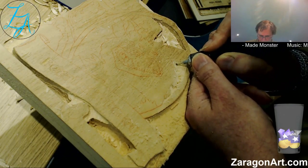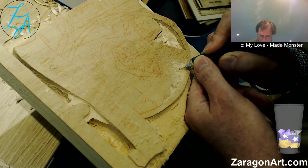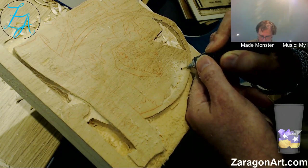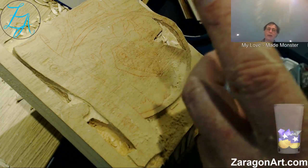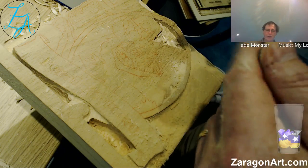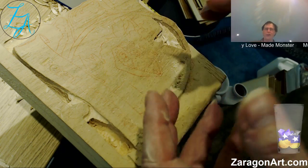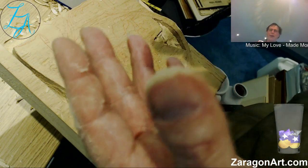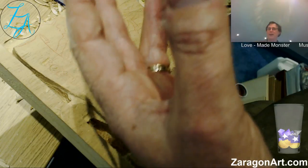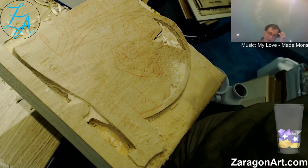But one of the things is, if the wood's really dark, you have less range of colours that you can actually put onto it. If you imagine going from white to black, let's say you can have 16 stages. If you start at grey, you may only have 8. If you start at near black, you've got 2. And so sometimes those woods can be difficult.